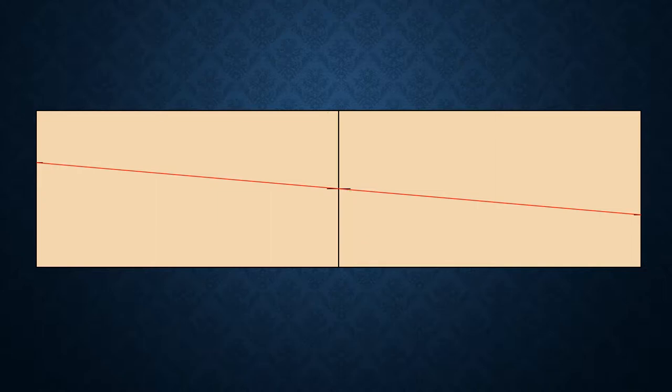Let's continue with the layout. Mark a line across the entire panel width, 4 1/2 inches from each end, here and down here at this end. Add a second line 19 inches in from the ends on both sides, or both ends. So here's the layout so far.